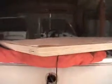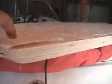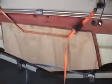so I made my new transom piece, and this is kind of hard to see. It's already set up with a piece of chopped strand matting that I'm going to use. This is the side that's going to be clamped to the inside of the transom. That board is there because when I clamp the new transom piece, I'm going to put screws completely through it into that board to clamp the whole mess together. And I'm going to wet down that chopped strand matting with a lot of epoxy. It's going to get messy, but I want to make sure it gets a good squish, and I get a lot of epoxy coverage in there.